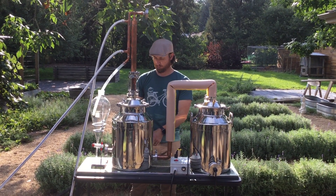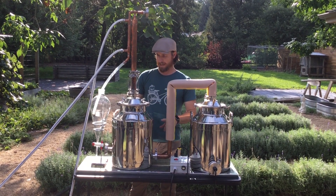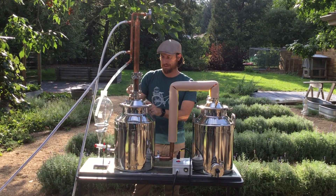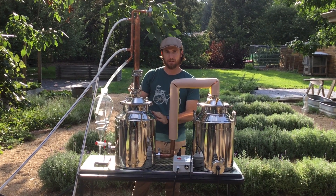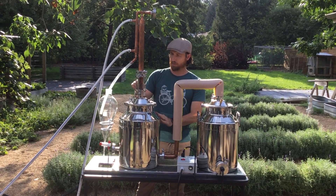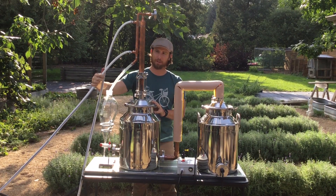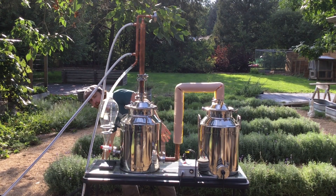As the steam passes through all that lavender it picks up the various oils and other hydrosols and carries them up and through this column. We have this packed with some copper — not to increase the proof of a still, but instead to react with some of the sulfur that might come out of the plant material, resulting in better smelling oil and hydrosol. As our steam passes through this column and out, we have cold water coming from the tap circulating up and through this little jacket and then back out, which goes back around to water our lavender plants.